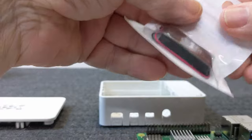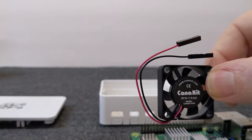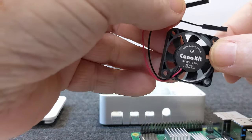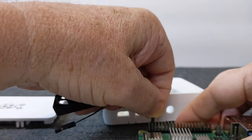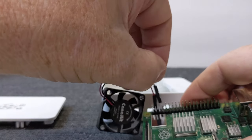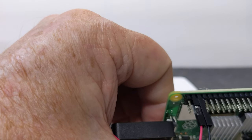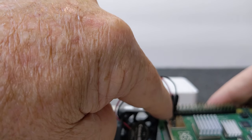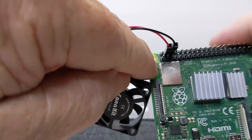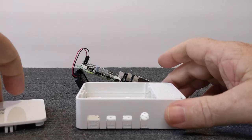Here's our fan — it has a red wire and a black wire. The red wire goes into pin 4 (the first of that top row) and the black wire goes into pin 6 (the second one). That's the second and third pins in from the end. If you want the fan to run slower, you can plug it into the very bottom pin instead. We're going to use pins 4 and 6.